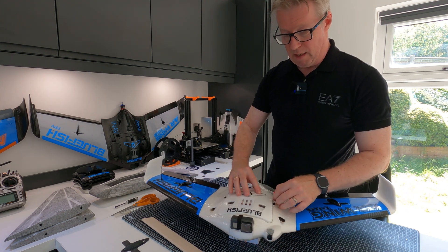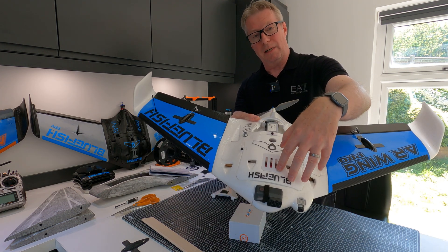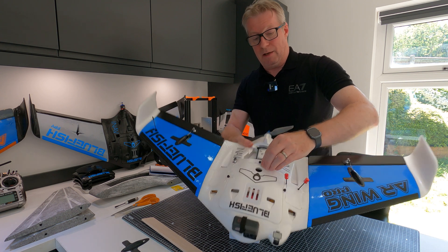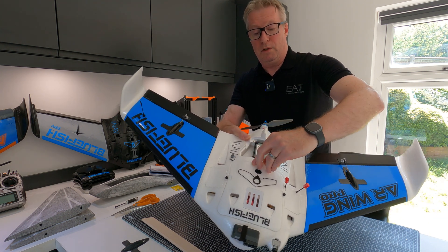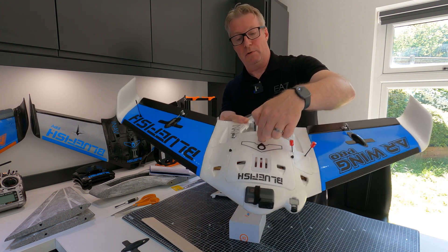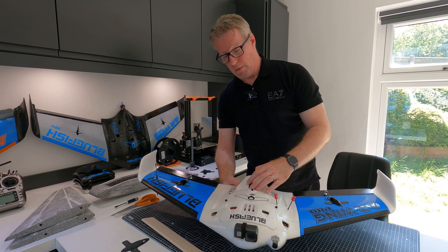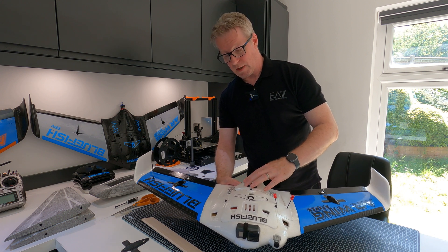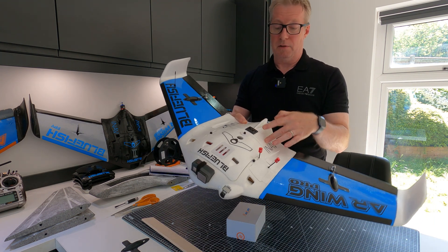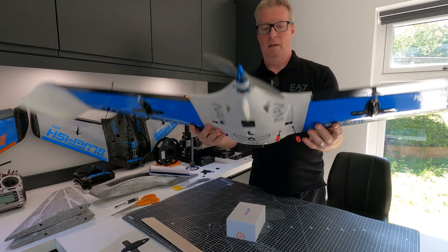On this plane I'm using hatches designed for the DJI Air Unit - you can cut away a bit on the inside to clear the strap and LiPo better, so the hatches sit more flush with big LiPos installed. I've also got a 3D printed hatch lock at the top which just stops it popping off. I actually lost a hatch going really fast where air pressure built up and popped it off. The E6000 coating also makes the hatches fit much more tightly and snugly.